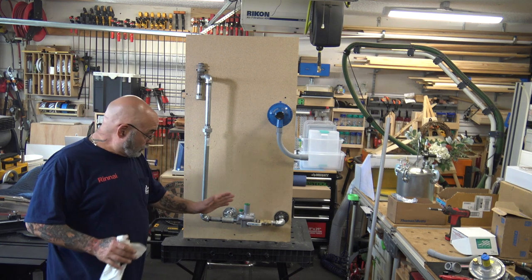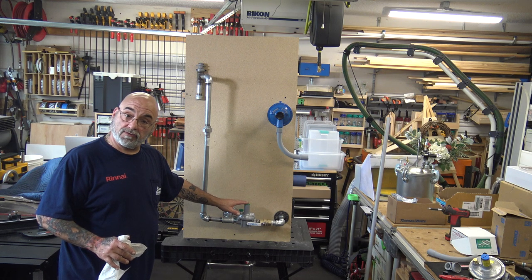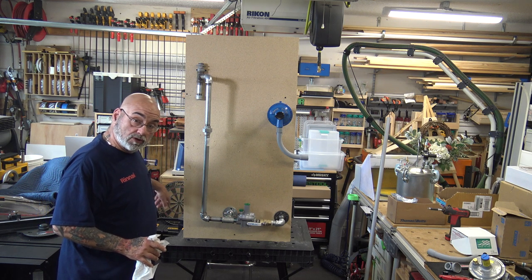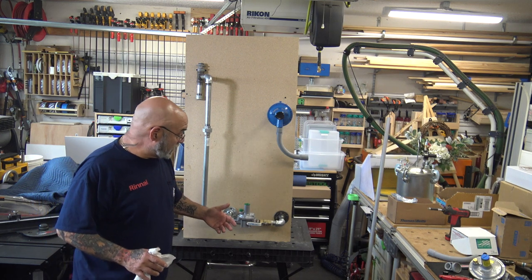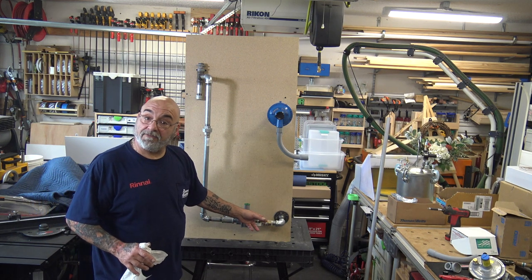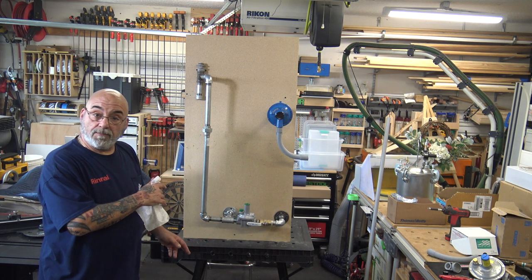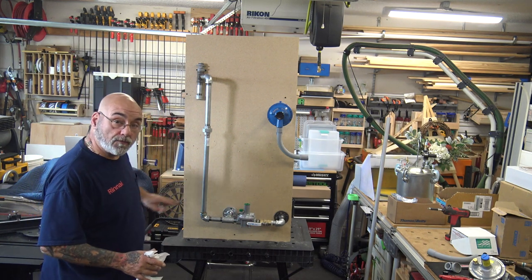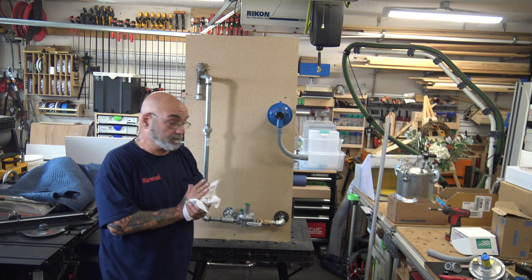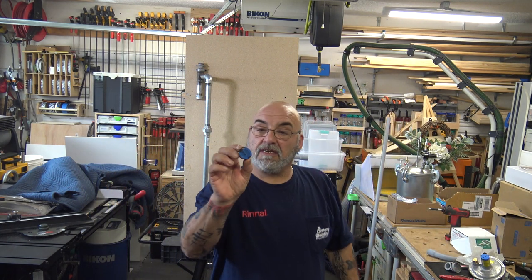So you don't put a 1.25-inch regulator and increase it here. You put a 2-inch regulator and then go to it. So you increase it here. Same thing. If you had, say, 3/4 or 1/2 inch feeding this at, say, 5-10 pounds, but your appliance is 3/4, 3/4 regulator, 3/4 to that large appliance. All right? So again, that's the little cap.